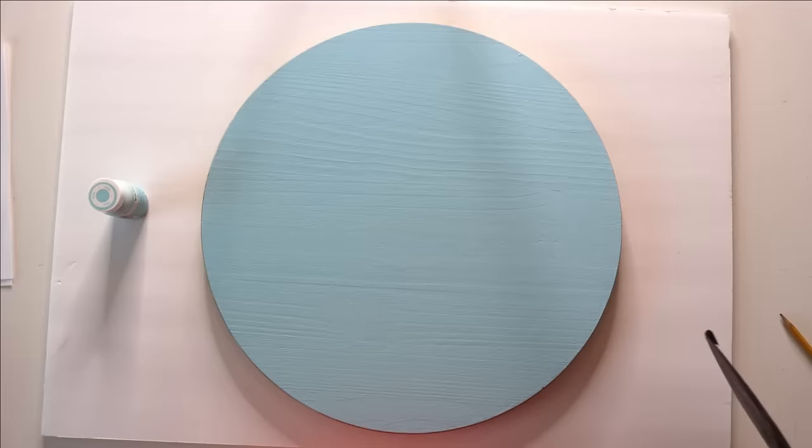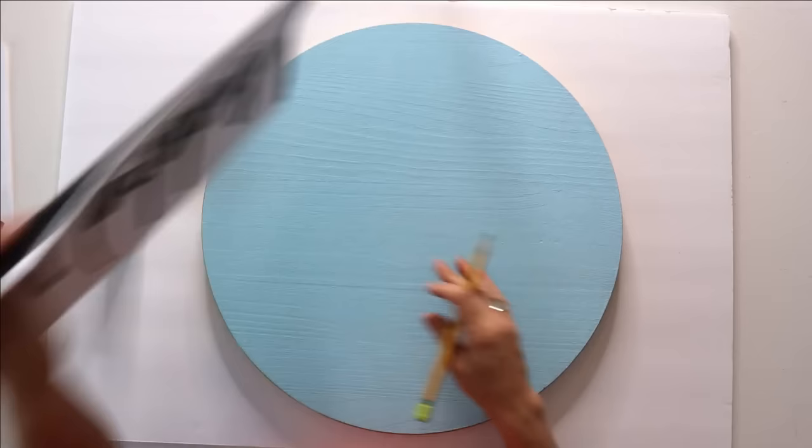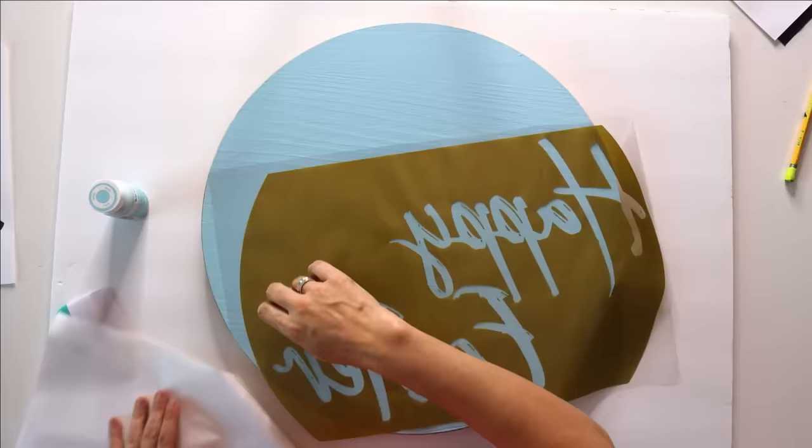If you don't have a Cricut, here's the process. Take the printable I provided in the description box below and lay it on your round. Place graphite paper underneath and trace the lettering. It will transfer onto the wood, then you just hand paint it in the gold color.